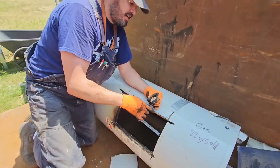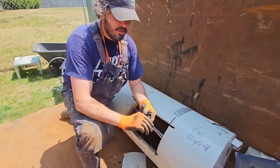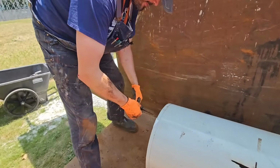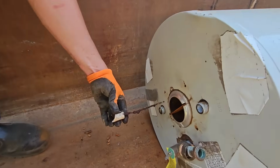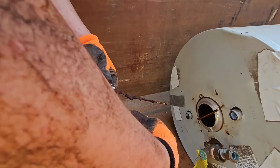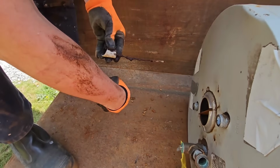And you can see how this is a part of the hot water nipple. Look, I just reached up and took this from here. Here's the hot water side of your nipple. This was on the inside of the tank. So you draw hot water up through this opening right here on the inside of the tank. The hot water will go through there, inside of here, and then out to your hot water fixture.